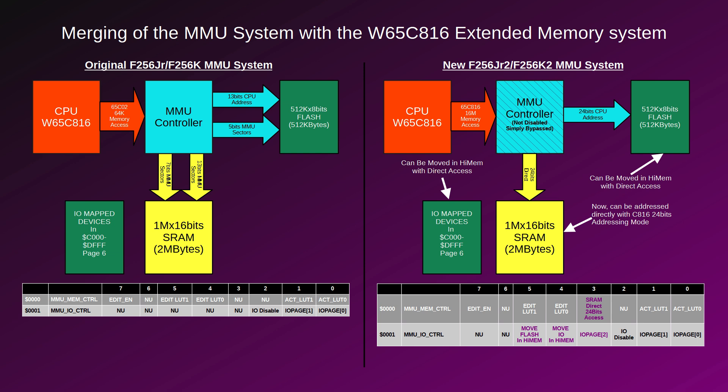As you can see, with only a few bits to change in the MMU and I/O registers, you will be able to remove the shackles without sacrificing the foundational aspect of the MMU system. In a nutshell: with one bit you'll have direct access to the SRAM; with another you'll be able to remap all the I/O devices into high memory; and with another, the same with the flash and cartridge. Basically, the best of both worlds.